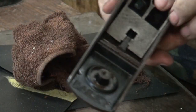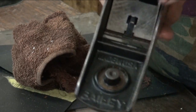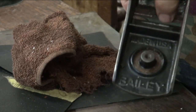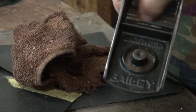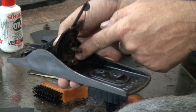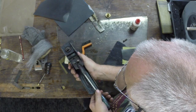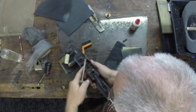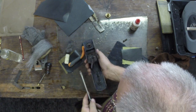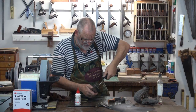I've set my frog up so it is right on the opening of the mouth — the back of the mouth. That screw there is the adjustment for that. Screw it up gently until you square the back of the mouth, then tighten down the screws.